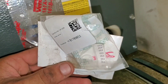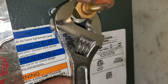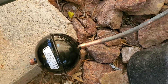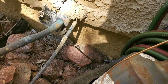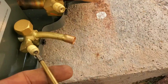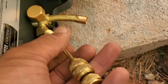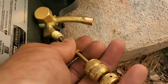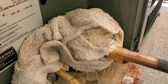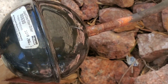Don't forget to install your orifice as well as your plastic ring. When you're tightening your connection, don't over tighten it. We'll do the same process with our condensing unit — dry fit all of our fittings and clean our lines and couplers using sandpaper. Remove your schrader valves for both your high and your low side; you don't want them to melt while you're brazing. Spray your valves with the thermal spray to protect the gaskets inside from melting. You can also wrap it with a wet rag. Make sure your connections are properly sealed.